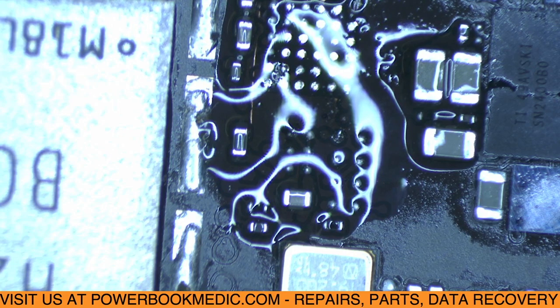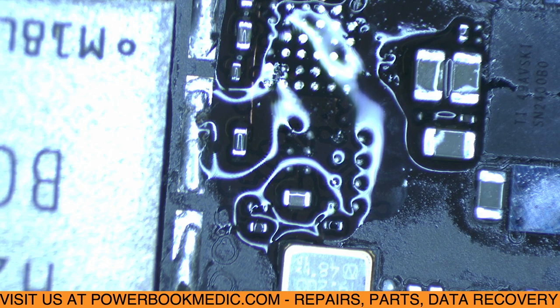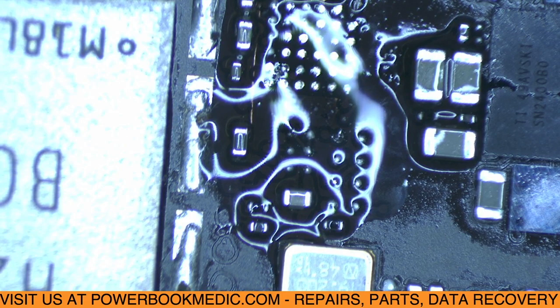And the compatibility with this chip: the chip that was on there was the 1610A2 chip. But the 1610A3 is also compatible with it, which is what I'm going to put on there. I'm going to go ahead and put the A3 chip on there. Go ahead and get that out.